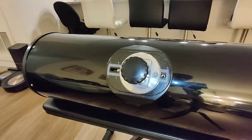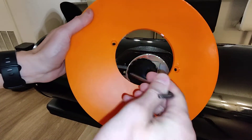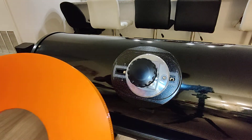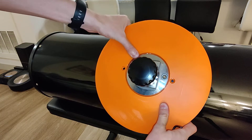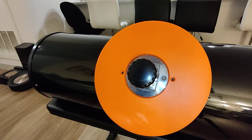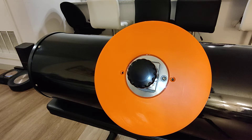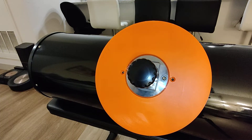I have another nut on this side, and they are already positioned relative to the bearing block — because this is how the wheel itself has been calculated. This diameter is nested to the circumference of the bearing block, which ensures the timing wheel will be absolutely centered against the bearing block and against your rotation axis. Now I need a certain leverage to fully press it on — and now it sits by itself, just nice and tidy.